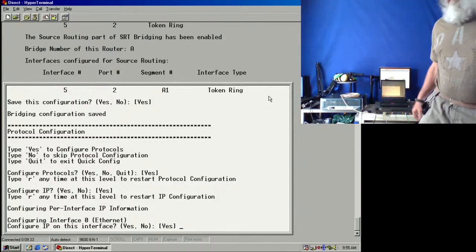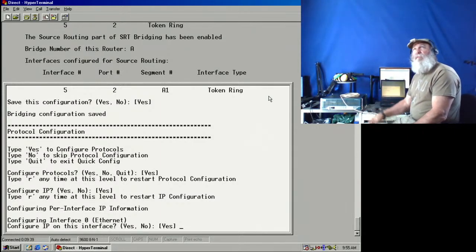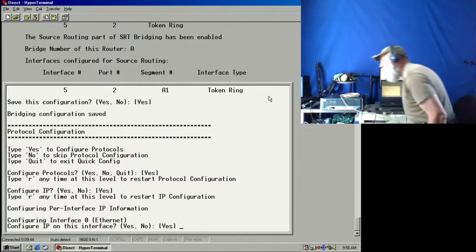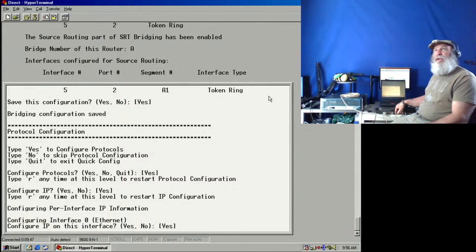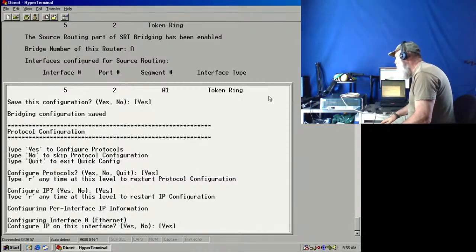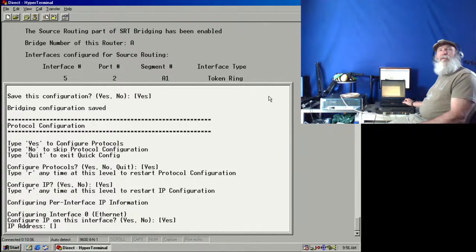And so I'm seeing on my switch, and that's ultimately a gigabit Ethernet line, I'm seeing a link light at 10 megabit per second. That's lit amber. And of course, with the AUI connection, that means that this Ethernet interface is 10 megabit per second. And so now the Ethernet interface, and of course, the brackets just show a blank.